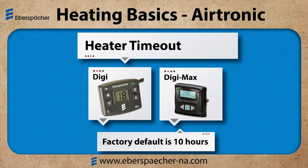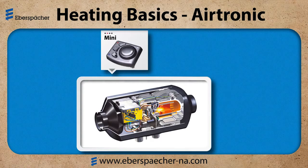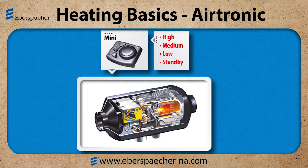Now let's look at heater regulation. We'll start with the Mini controller. When I activate the heater using the Mini controller, it sends a resistance value that is read by the ECU. On the side of the ECU is an air temperature sensor. It reads the air temperature as it's flowing through the heater. So as my heater regulates high, medium, low, and into standby, the flame goes off, but the fan continues to turn. We need to keep pulling air across that sensor. Once the air temperature cools down, the heater will restart. So it's important to make sure we have good airflow in this application.